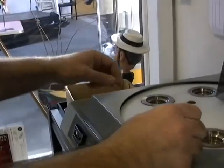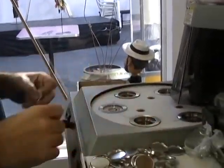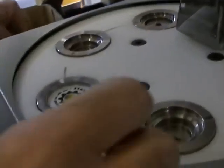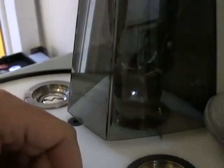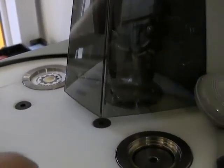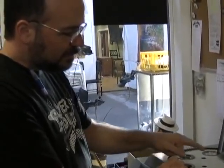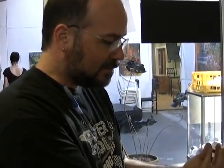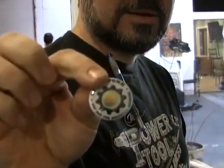As this die plate runs around, I load it. I have a foot pedal, which is the dead man's switch to keep it running. So I'll put in the first one, get it going. What happens here is that as the die receiver with the art and the shell and the mylar gets back here to the die, it gets pressed inside and loaded into the die. Then the turntable advances, those three parts are loaded into the die, then the pin back is in the next die receiver, then it crimps the whole thing together, and sends out a working button.